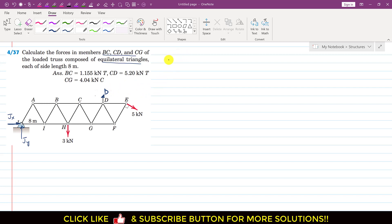If we apply the summation of moments about point J equals zero, and determine this D force, we will be able to pass a section and analyze the right-hand side of the truss without needing to find the reaction at J. Assuming counterclockwise moment is positive, the 3 kN force produces a clockwise moment about J, so we write minus 3 times 16 (perpendicular distance = 8 + 8 = 16).